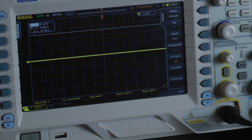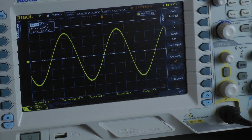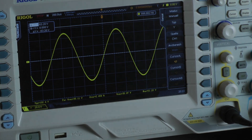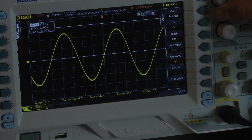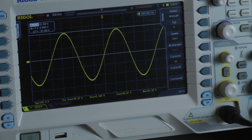Now a 4-ohm mono load is connected to the amplifier's bridge terminals, meaning I am testing 2 ohms per channel, both channels driven at full power. I got a voltage of 51.6 volts. The amplifier delivers 170.7 watts into a 2-ohm load per channel, both channels driven at full power — so it reaches almost its rated output power.